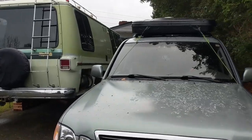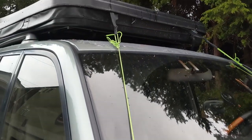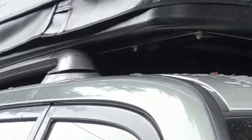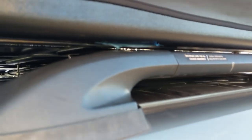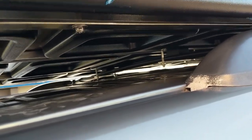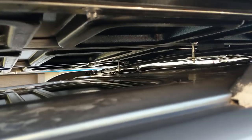This is what the truck looked like when it first got to Portland. I had these green guy lines installed just to keep the tent from bouncing up and down as I rolled down the freeway. But take a look at the left — you can see the gap where the cover is coming off the foot for the roof rack. There's a mismatch in the gap between the front-to-back rail and the cover on the foot. The thing was bouncing constantly driving back from California, and this constant flexing was for sure going to fatigue the rack until it broke. So the rack had to go.